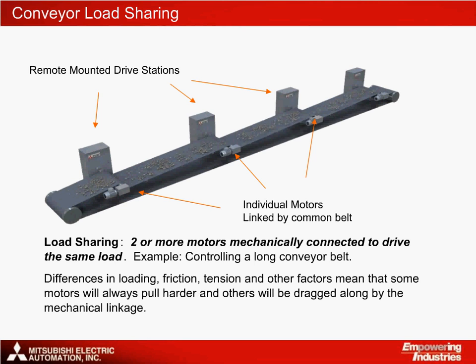There are many examples of load sharing, probably the most common one is a long conveyor line. It is not practical to only drive the load at one point because the driver motor would be too big and the load at one point on the conveyor would be excessive. To avoid these problems, several motors are connected at regular intervals along the load. In a perfect load sharing system like this, all the motors will share the load equally between them, and we will still be able to control the whole conveyor line as though it is controlled by a single big motor.